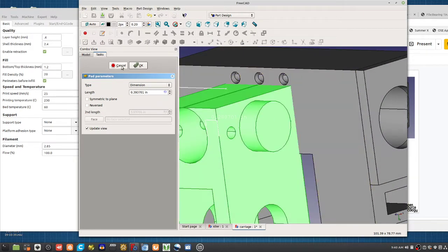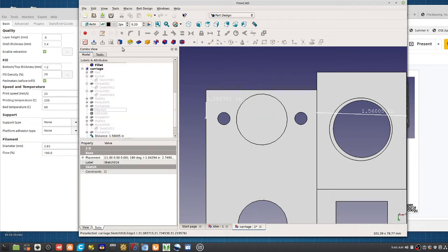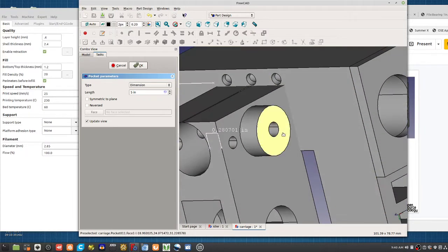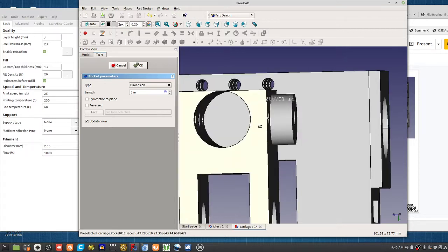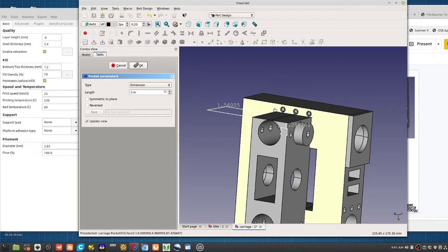So now on this pad here, we can make your 5.5 millimeter hole again. So now you've got this protrusion where if you thread in a bolt through that, you've got much more grab on the bolt. We should shoot for about 3/4, at least half an inch. I mean, we're talking about 1 inch rods and carrying forces on the order of 100 pounds, let's say. Unlike the printer, where the forces are on the order of a few pounds.